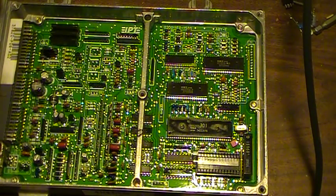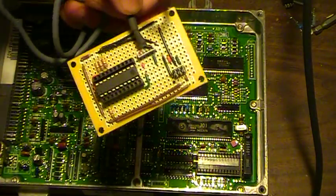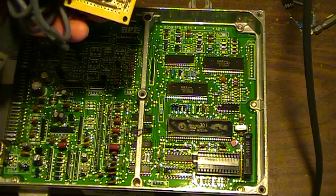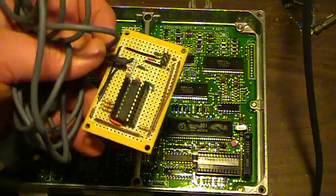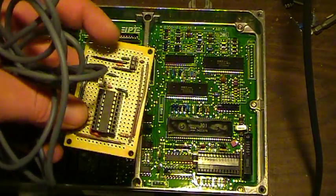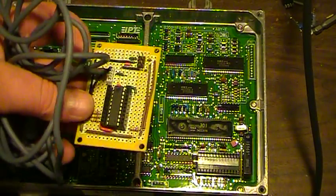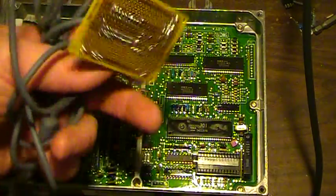Let me see if I got my programmer. I've worked with the ATtiny 2313 chip a lot — a microcontroller. In fact, that's one in there, right there — and I built this programmer. This particular programmer: I only use the USB to supply power — the ground and 5 volts to the chip — so I can program it. I use the USB to provide ground and 5 volts, and then I put in a cable here that actually runs to a parallel port, and I send my code to this chip through my parallel port.